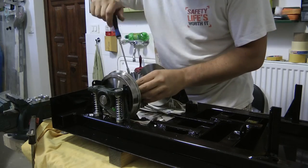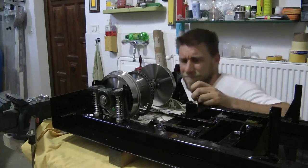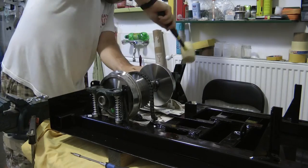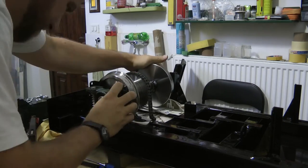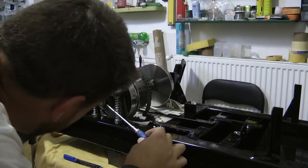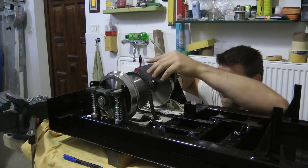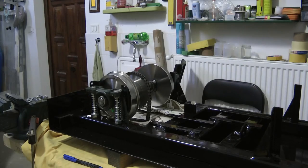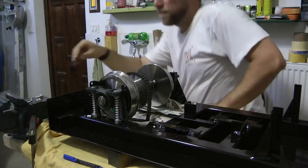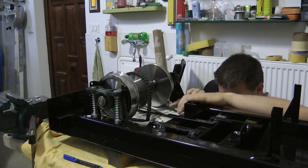Some of the paint will eventually chip away and then it will be free again just like it was before. Once it's all on, I checked the gauge — according to the 7¼ inch society, the flange-to-flange distance is 173mm. So I was checking it with a ruler and then aligning the set screws with the notches I made into the axles, so the set screw can bite into those notches to make sure the wheels are not going to spin around. There is one set screw for each wheel, then one for the sprocket wheel, and then two at the ends of the axles.